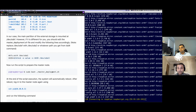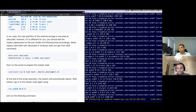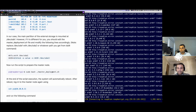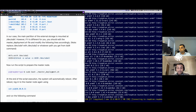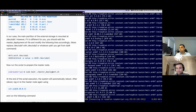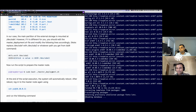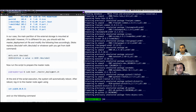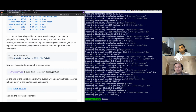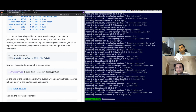And if we talk about the power consumption, that is also very different, because since it has less clock speed, it uses less power to operate. If you compare with the Raspberry Pi in idle mode, that means if you don't connect any peripherals to the Raspberry Pi board, it consumes around 3.4 watts or something similar. If you connect all the peripherals, it goes up to 7.6 watts. There are different variants of Raspberry Pi as well. We are talking about Raspberry Pi 4B, so the data that we are providing is for Raspberry Pi 4B. But there is another Raspberry Pi which is basically equivalent to an Arduino board, called Raspberry Pi Zero.